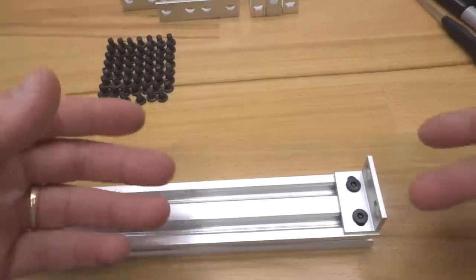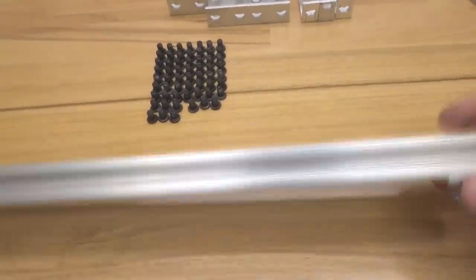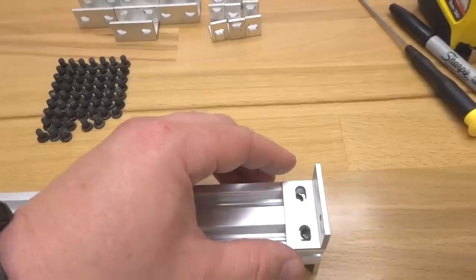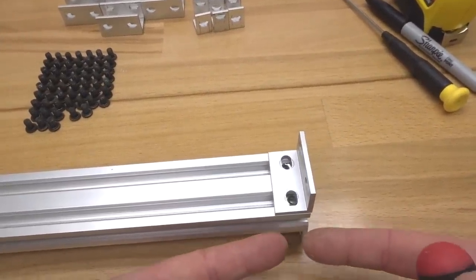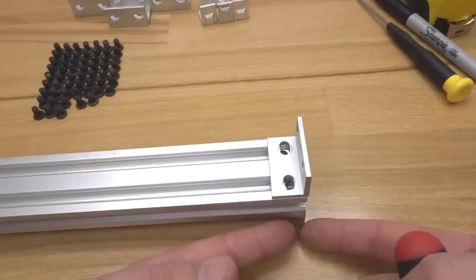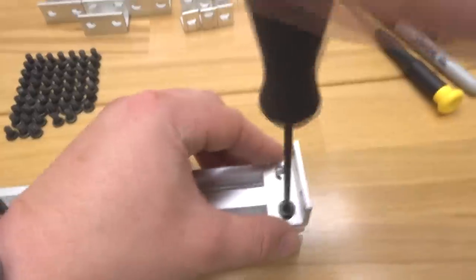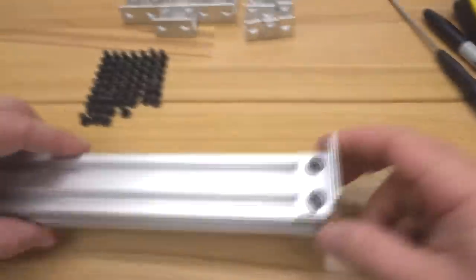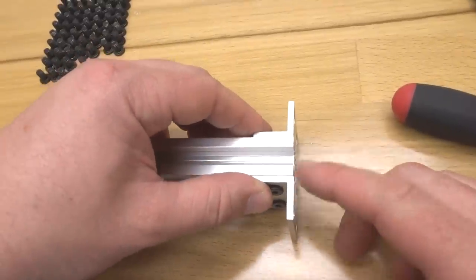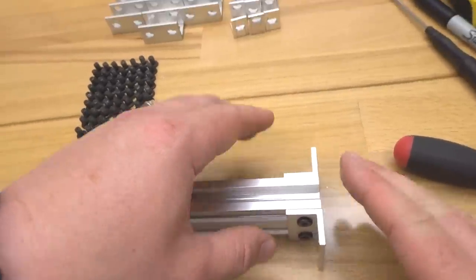With that being said, let's go ahead and rotate this around and we'll complete the same process for our additional sides. Now this is going to differ a little bit because it's a mirror image. So right now it looks like it's on the bottom portion, but really it's the top compared to our other side. So make sure you guys notice that. All right, so that's what a completed double L bracket configuration looks like on the end of our 20 by 40 V-slot. Now we're gonna do the same process for our other side.